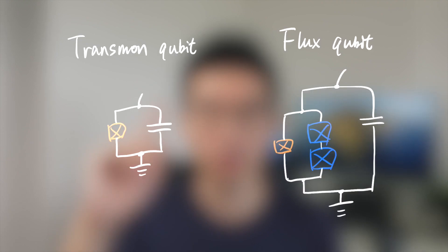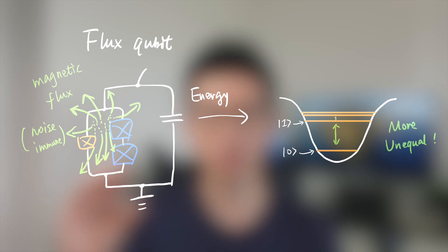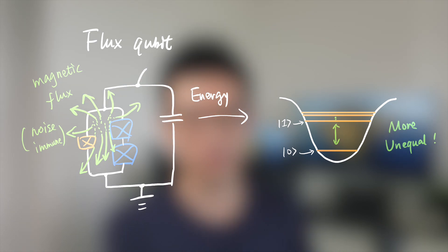So people came up with other superconducting qubit architectures to overcome these issues — this is when the cousin of the transmon qubit comes in: the flux qubit. The only difference between the flux qubit and the transmon qubit is that the flux qubit replaces the Josephson junction with a loop containing asymmetrically shunted Josephson junctions. It's called the flux qubit because its frequency is tunable and can be controlled by magnetic flux. The asymmetrically shunted Josephson junctions reduce the qubit's sensitivity to flux noise, and most importantly, this architecture can further isolate the lowest two energy levels.